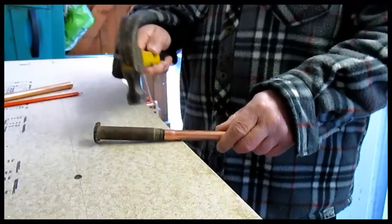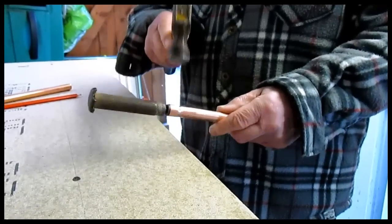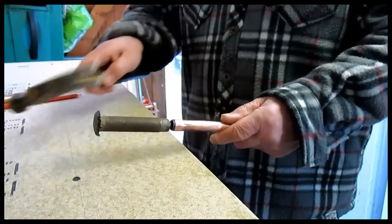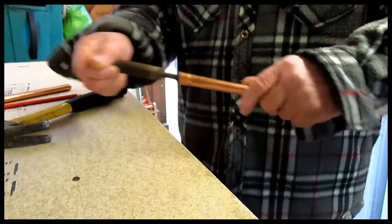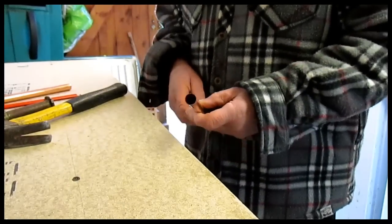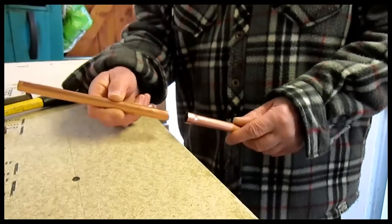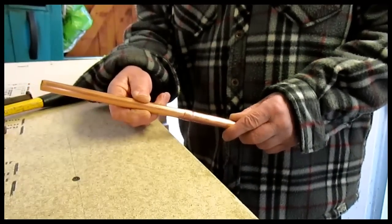What I want to do now is just slightly tap that edge, just stretch the copper a little bit — makes it easier to get out. And now you've formed a socket. Your next piece of copper will just slot into there like it's a coupling.